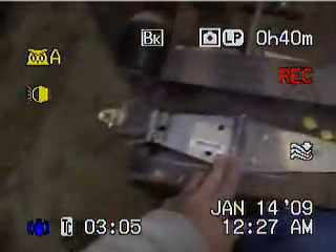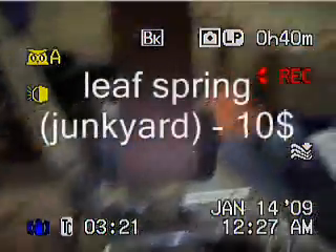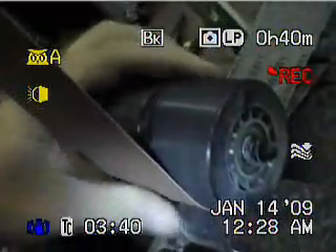All this stuff is made from junkyard parts. These are gate hinges — got two gate hinges here, and there's a piece of leaf spring I just bent up. I put a hole in it on this side and stuck a bolt through there. These are roller skate wheels right here, used as idlers. I just welded that bolt in there, put a little spacer inside, stuck the roller skate wheels on there, super-glued them together, and put the nut on.